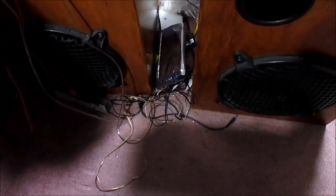There's also quite a bit of hiss as I turn the volume up. A lot of hiss — it's pretty noisy. Listen to all the noises it makes when I cut the power: a whole bunch of noises and then it plops and turns off. The noise is not coming from the power amplifier because it's still on, and if I unplug the amplifier input, it is dead silent. So all that noise is coming from the tone control board.